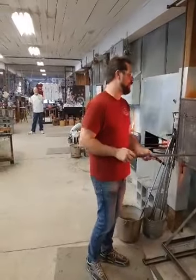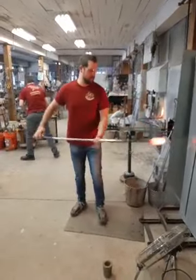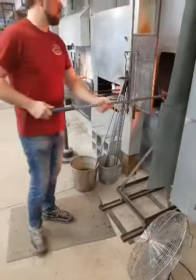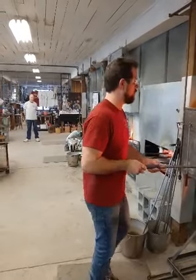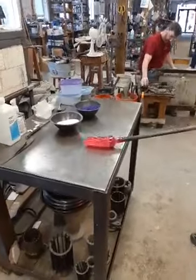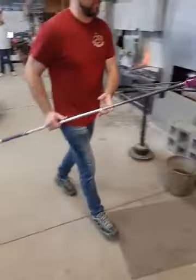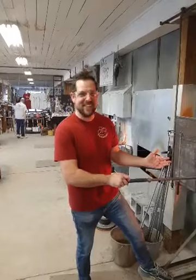That's it for the blue pickup, now ready for the optic. Into the optic mold with a lot of air pressure — that puts the ridges in it. Then the way we'll get the fishnet is to twist that. By leaving the iron in nearly one spot but turning in only one direction, you see the twists appearing. The glass near the pipe twists the most — you get a real tight twist. It's a little harder to get the twist in the outboard section.